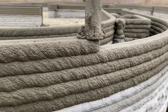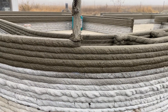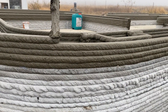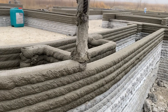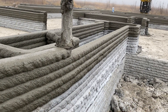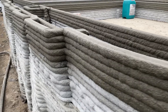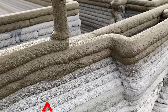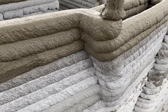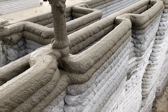Notice how the exterior is much lower than the slab — that's an interesting feature. I wonder if the wall was printed before or after the slab was poured; perhaps they might have used it as formwork. You can see some small, minor aesthetic cracking in the walls, but it's a very good sign that they aren't extending the full vertical height of the wall. Let's take another look at those parametric designs. You can also get a glimpse of the rail system, which seems very robust. This wall demonstrates an incline, which is an overhang of perhaps a couple degrees. If you look at the arrow on the screen, you can see the dual bond epoxy layer that they put between a dry layer and a fresh new layer to ensure they get a strong monolithic structure rather than a weak cold joint.